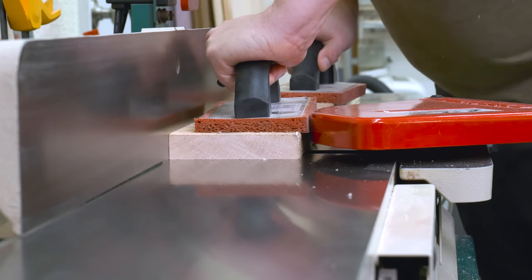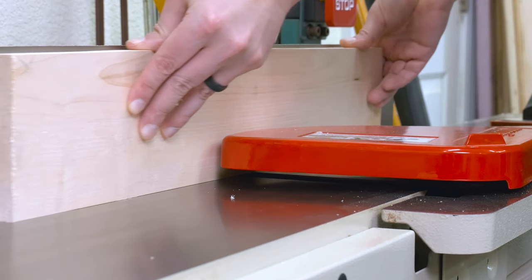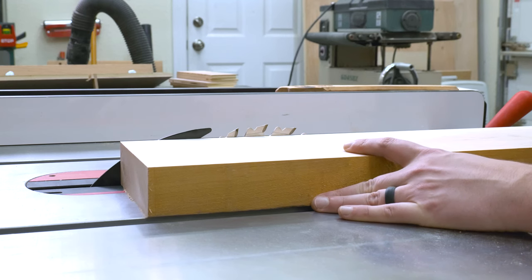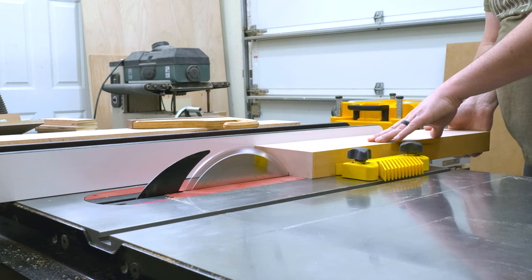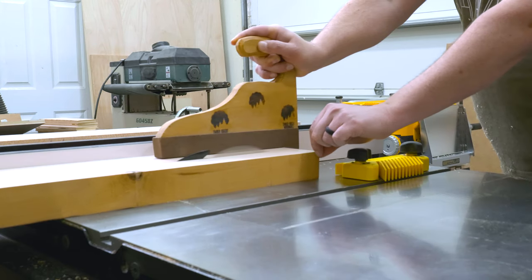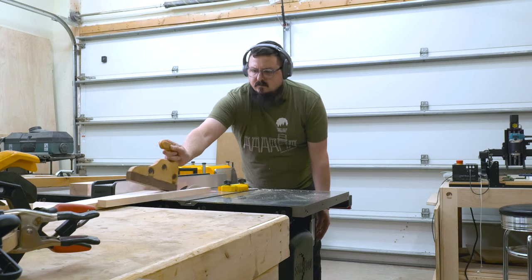While that dried I started milling the hard maple for the veneers, which I'll use for the bent lamination. I milled a lot more material than I actually needed to ensure I wouldn't have to go back if any failed. With boards jointed and planed I took them to the table saw to rip them down, leaving them slightly oversized to trim to final width later. I'm using 8-quarter material since it gives more room to work with, but I'm just using what I had on hand.